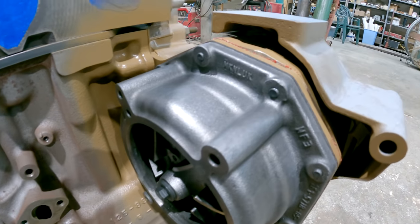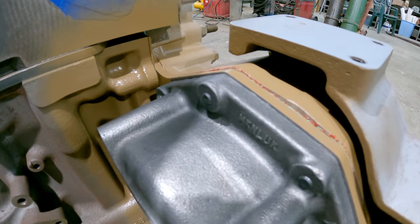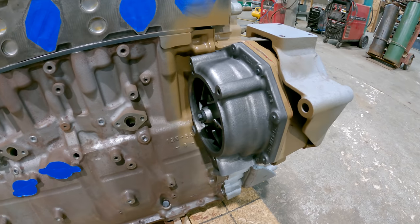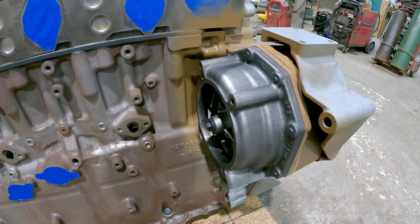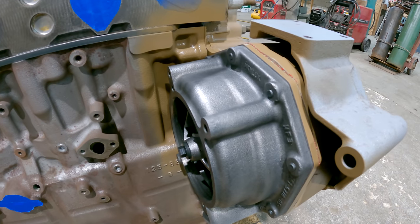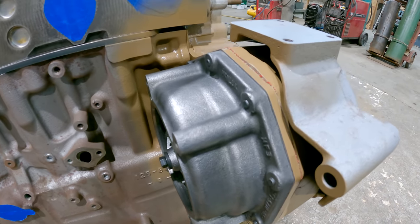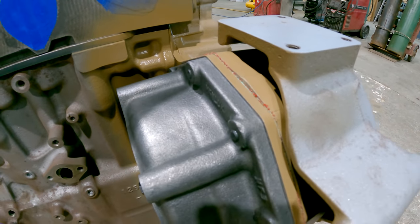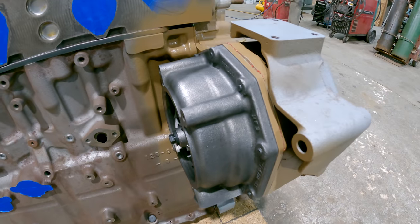You can see a little bit of anaerobic sealant squeezing out, and that looks good. The anaerobic sealant, you don't have to worry about it on the inside because it's soluble in oil and it won't set up except for in the absence of air. So you could come back to that little bit of squeeze out in a month and it would still be liquid. It's not going to set up. Of course, I'm going to wipe it off, but